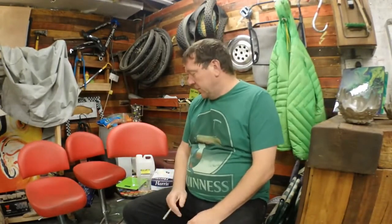So, hopefully you saw the chair looked okay. There's a few little bits, but you really have to stare to see them. Apart from that damn bristle from the paintbrush. So, lessons learned. One, don't use a paintbrush. Use a roller, a little sponge roller to push the epoxy around. So much better. You don't get the bristle left there, which you never spot until the whole thing's set.